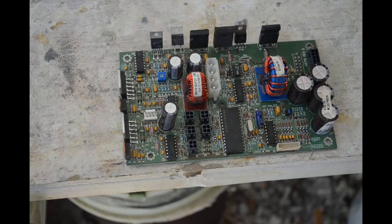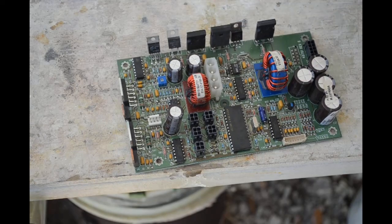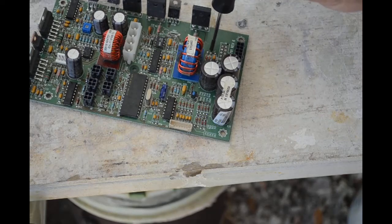On this one back here, this big two-leg diode back here, D1. So they're calling that D1, and then these little glass barrel diodes over here, they are D5 and D6. So different board manufacturers are going to label them differently, but that's basically how you can tell whether you've got a diode or not. It's going to be labeled either as CR something, D something, or ZD something.